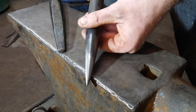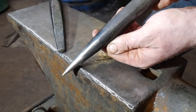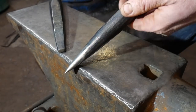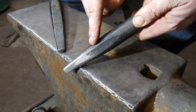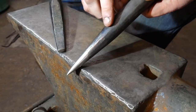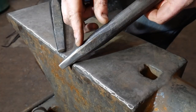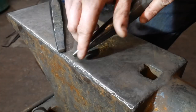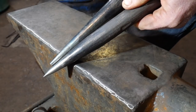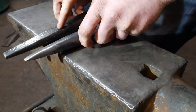Here is our hammer eye drift after grinding. I was going to show you me grinding it with the angle grinder, but I kept getting my elbows or arm in the way. Nice smooth taper transitions into that blade shape at the end. I used a 40-grit initially, then swapped to 80, then 120, then a scotch-brite to tidy it up — just to make sure this is as low-friction as possible. The forge-finish scale up top should be resistant enough for the job. Make sure it's smooth, and it's best to make your hammer eye punch and hammer eye drift in pairs so that the taper of the drift matches the taper of the punch.